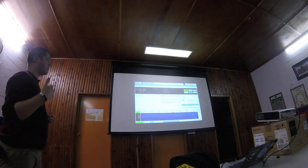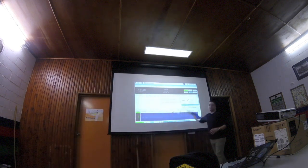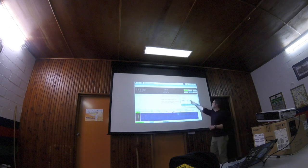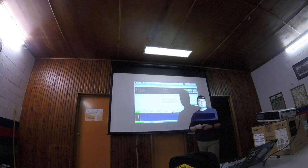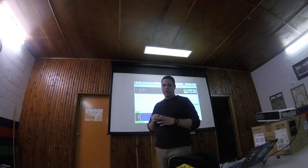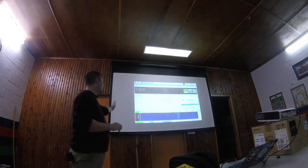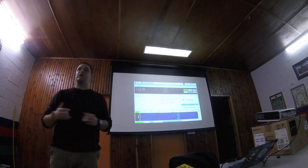What are some of the other things we can do? So, we can do groups. Much like a net, so if you wanted to have one, which Friday nights is generally the JS8 net on 80, you can just send an at and an agreed text. In this case, it's JS8 VKZL. And anyone that's also listening on that group, anywhere in the band, anywhere in the waterfall there, you can get an alert.